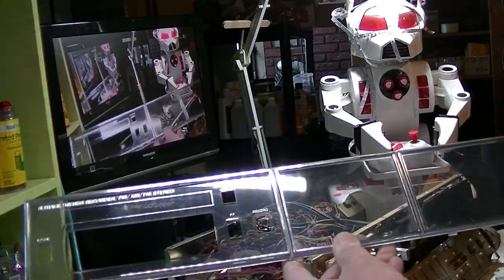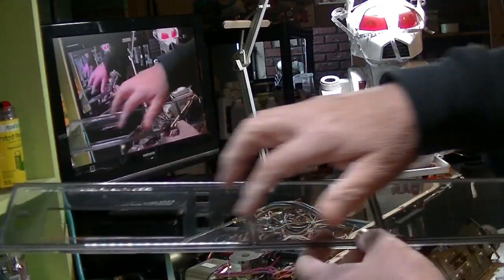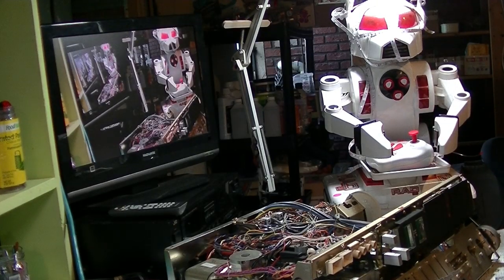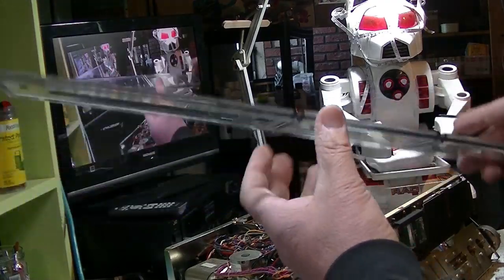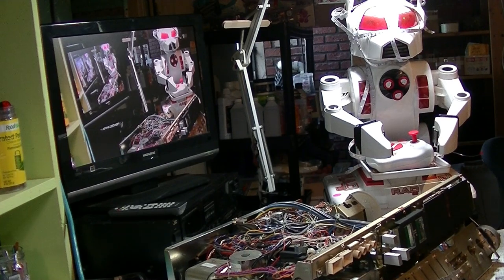I did it a couple of times to remove scratches when the whole lens was covered with scratches. It's not deep, so I tried to remove everything using the water sandpaper. Then after that, this plastic cleaner, as the final touch, makes it a very clean, nice lens. So sometimes you need to work hard to clean up the plastic lens.